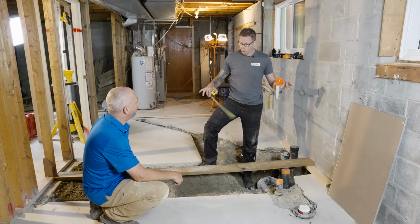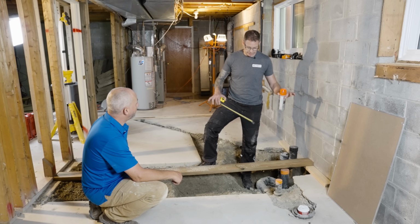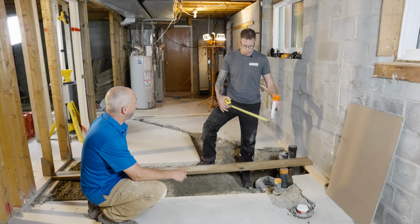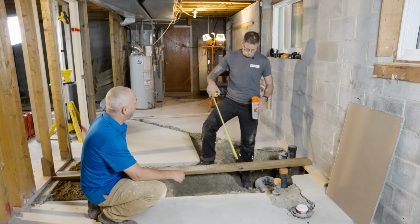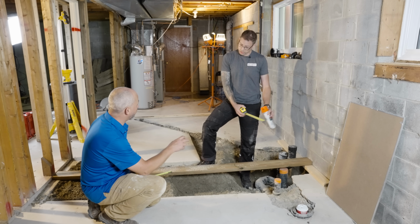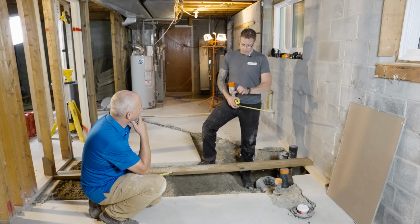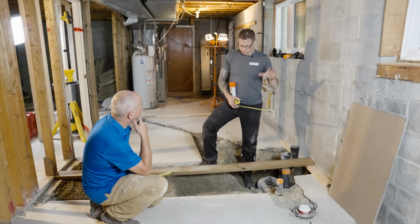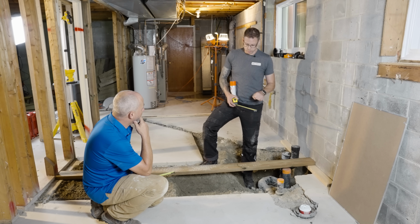Once all the walls, everything are completely done, everything's in place, and your shower goes in, and now we realize there's been some changes. We pop that 2x4 frame out that's around the base, around the shower pipe. And then we can make minor adjustments underneath with 45s that are rolled, and it'll give us about 2 inches of swivel all the way around. Once you're in, you reconcrete it, drop your base on.